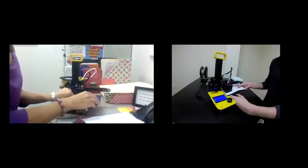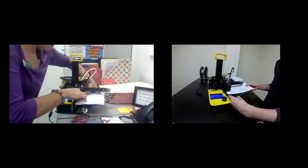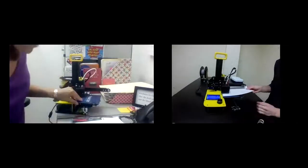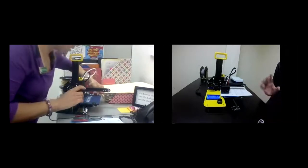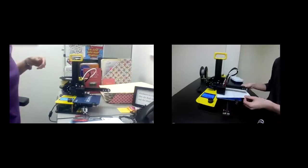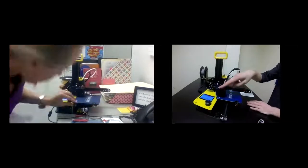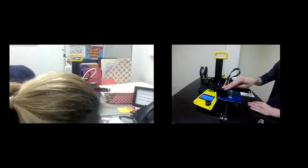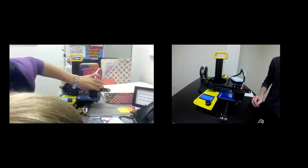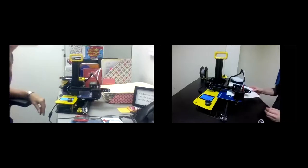Mine is too far away so I'm raising mine. You should almost hear the paper dragging against it. If you feel happy with that first point, leave it and move to the next one. The outside ones are easier to reach. Slide the extruder head over to the next spring and line it up, then again place the piece of paper underneath.